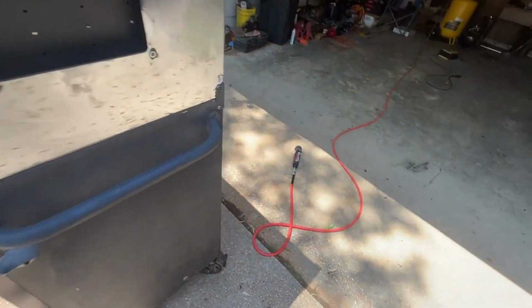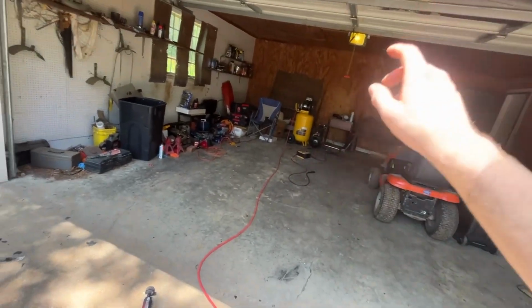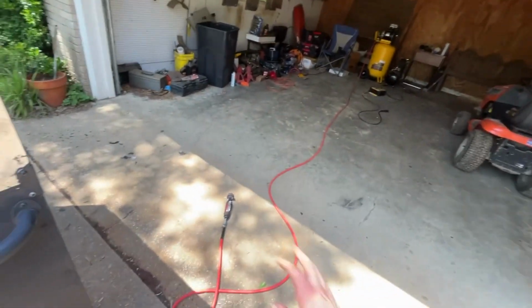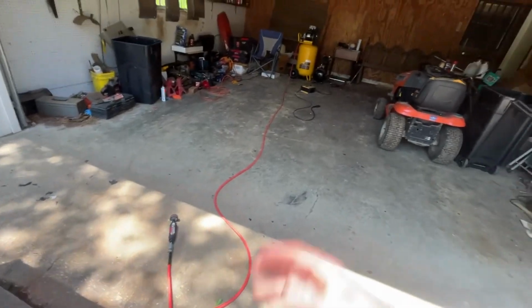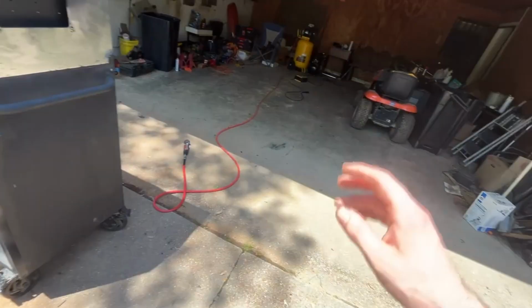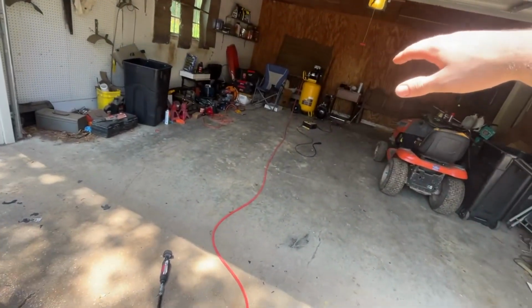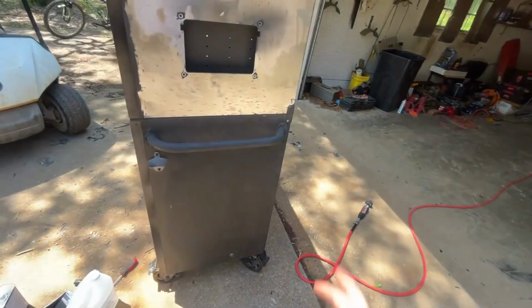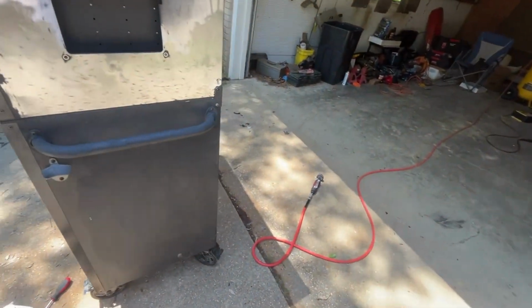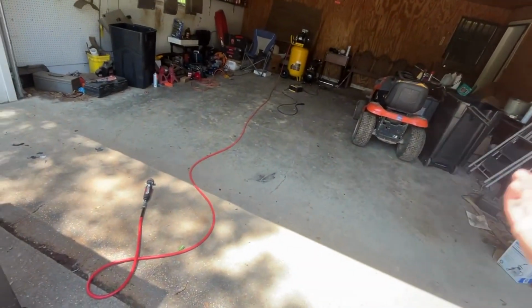Alright, so I just had a very good test run with my die grinder here. I was right, the thing is going to be running the entire time I'm using this thing if I use it non-stop, which you can. You can use it continuously with this air compressor if you regulate it at 90 psi, but it will get weaker. In fact, the tank pressure dropped down to about 40, but believe it or not, it's still usable at that pressure. It's just not as strong as you want it to be. And I wasn't expecting it to stay at 90 all the time.